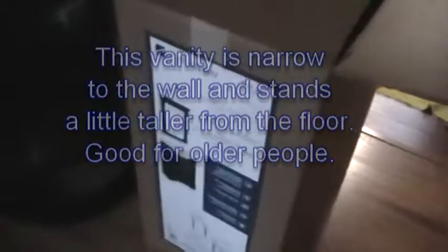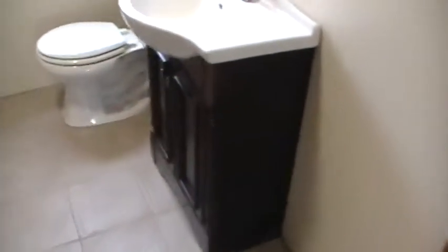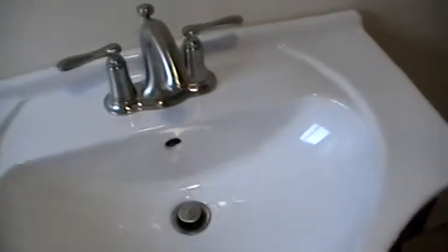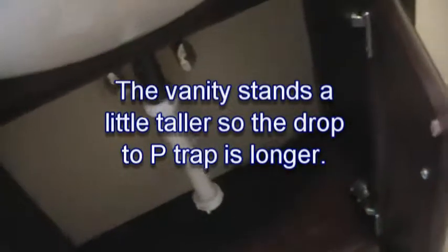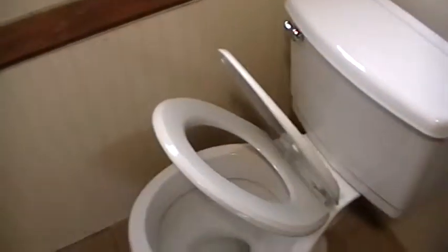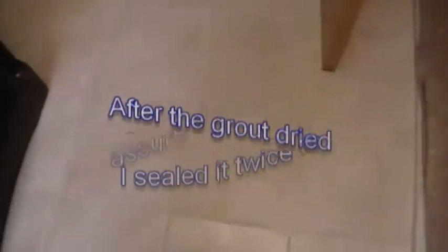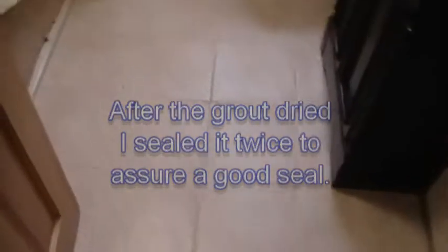I used a Lowe's ten dollar card and got ten percent off — and that worked at Home Depot. That was an easy install. The new vanity is small so my mother will have an easy time getting in the door. It's a multi-faucet that went in real easy, had its own water cables on there. Things lined up pretty well underneath — I always had a little gurgle and now I get a longer drop for the p-trap, so that should eliminate the gurgle. It's the old toilet with a new Bemis seat so the toilet doesn't slam. Grout came out nice, really blends in well with the tile. We'll let it dry out for a couple more days before we seal it.